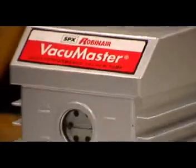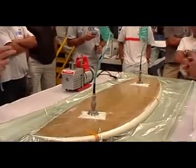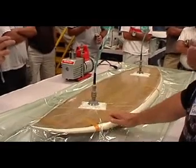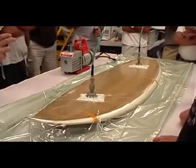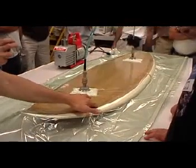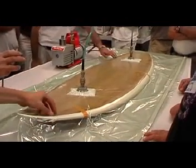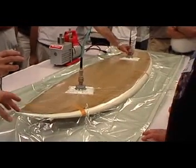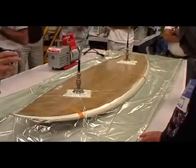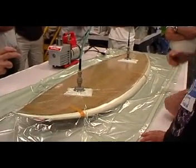We were just talking in the other room: if you have shop air and a big compressor, go down to those catalog sale places. Harbor Freight? No, they still have inventory. Oh, they do? You want to get a high CFM, because if you get a low one, you're going to run your compressor dead. Fiberglass Supply has a nice one. Get these Venturi systems. You've got shop air coming in and it causes a vacuum Venturi, pulling vacuum off the other end, and you're going to be happy.